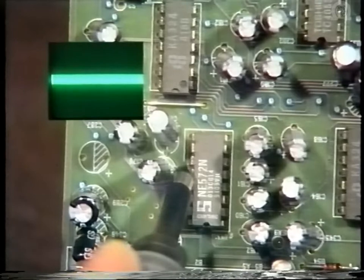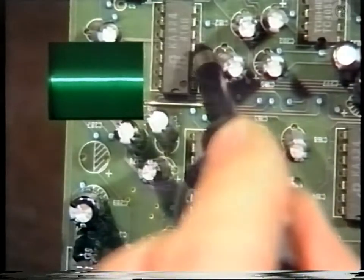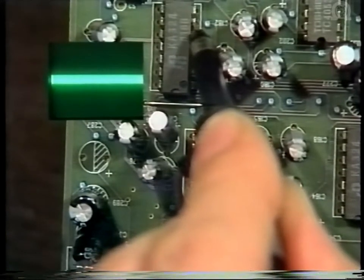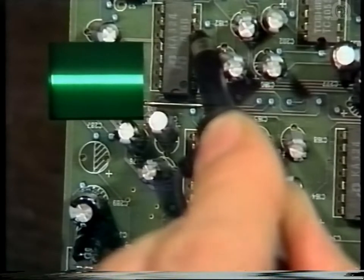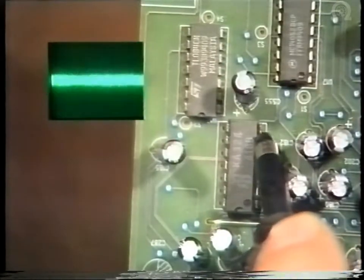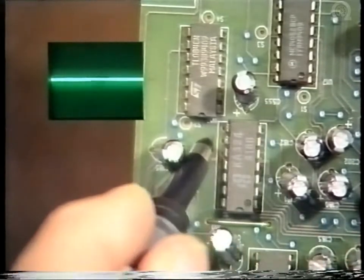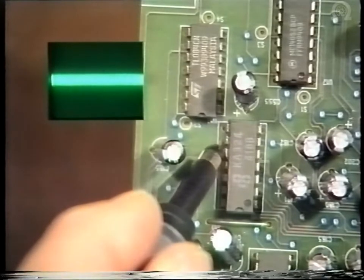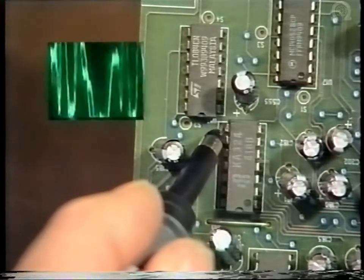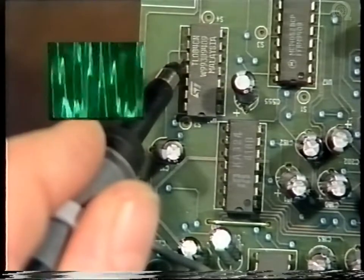Now back up to U16 to pin 5 and pin 6, which are inputs. And coming out on pin 7, back in on pin 9, and finally coming out at pin 8, where it then goes to U15, pin 10 and pin 9,